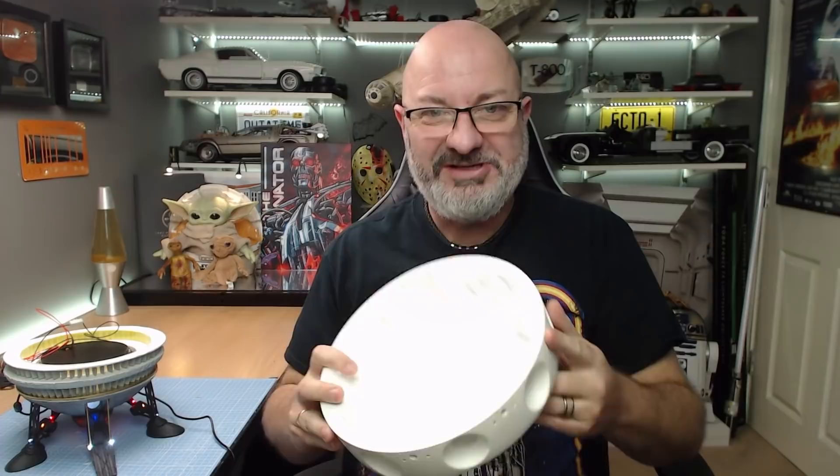I'm also going to be putting the lamp engines in. I'm not using optic fibers — I like LEDs so much. I've ordered enough for nine, 18, 27 LEDs total, to go for these three things all the way around. That's two three-millimeter reds, one five-millimeter white, and then some bright nine-millimeter white LEDs for the lamps. That's going to be this week's challenge.